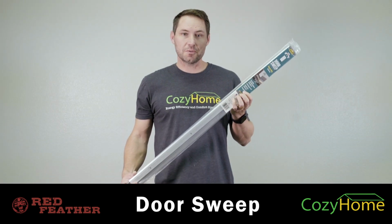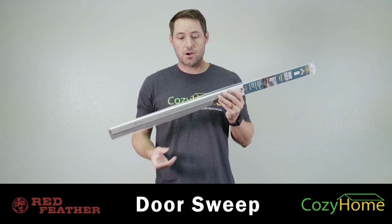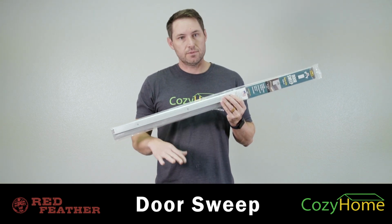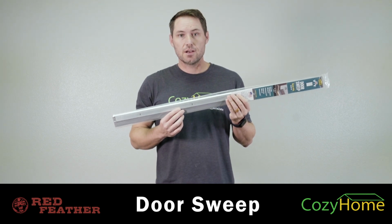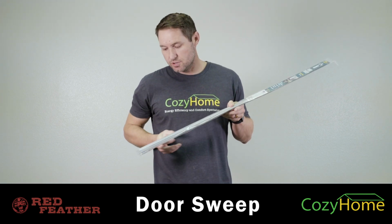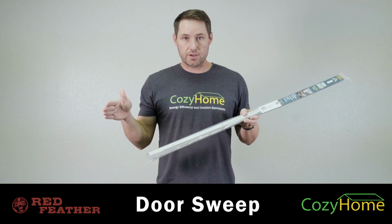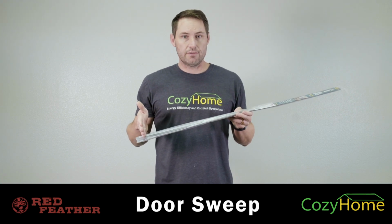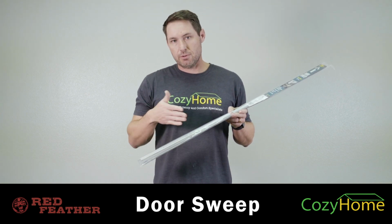This right here is what's called a door sweep, and this is what seals your door to your floor or threshold in your home. These ones are adjustable, so you can move them if your door shifts over time, or a gap opens up. You can always take these off and put them back on, readjust them. They're really easy to install. One thing you do need to do is cut them to the width of your door. What I usually recommend is get a measuring tape, measure the width of your door, and then cut these down. A hacksaw works the best for this, if you don't have a different type of power saw or a Sawzall, but that's how you can cut it to length.